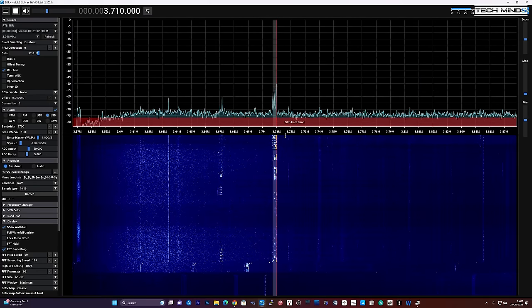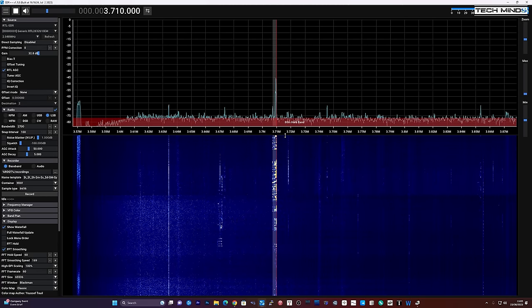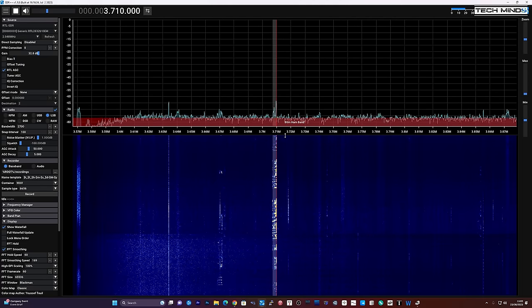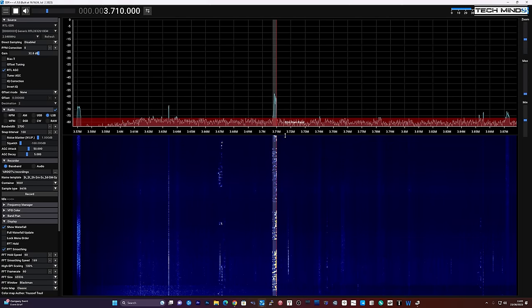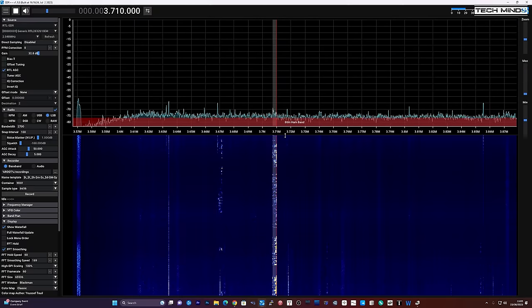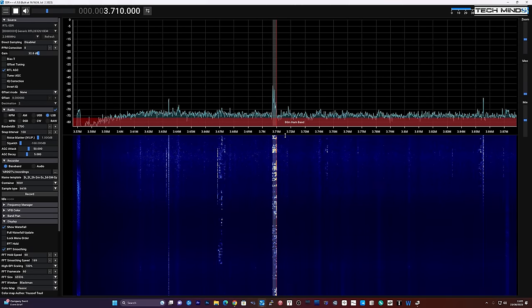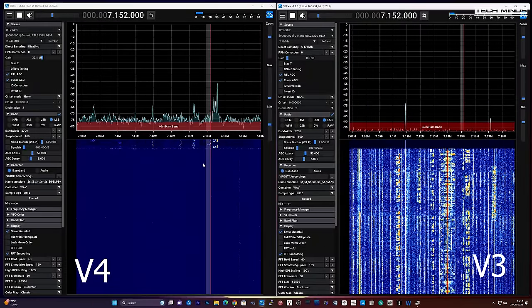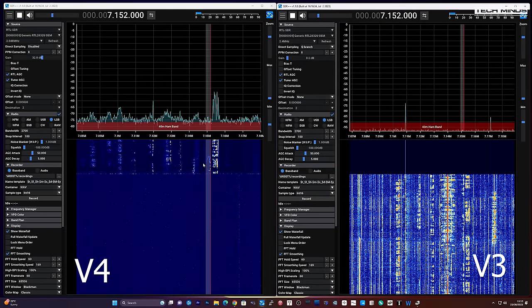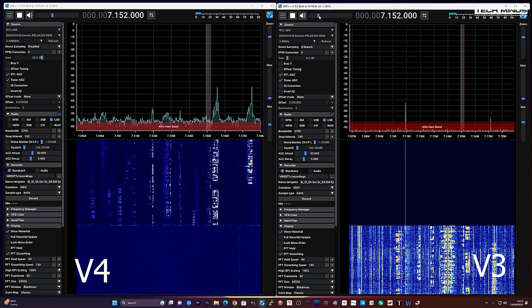What I tend to do is use a one-to-one balun, which blocks any common mode from the antenna, get the antenna disconnected from the ground, get a dipole up there — and then the earth isn't quite so important, and the noise isn't quite so important. As you can see here, the V4 works pretty darn well on HF. But now let's perform a comparison against the V3.